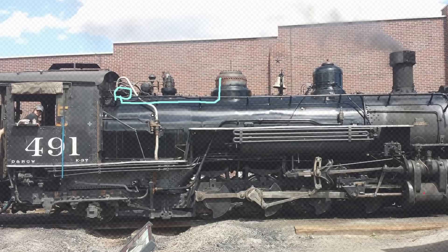By appliances I mean your starting valve for your injector, electric generator — also known as a dynamo, which just gets steam run through a turbine to make electricity — your air compressor which gets its steam from there as well, and your hydrostatic lubricator depending on locomotive type.